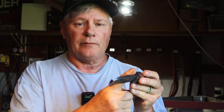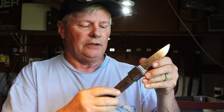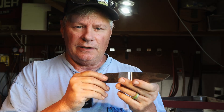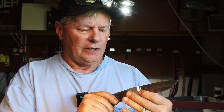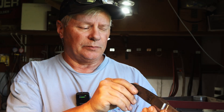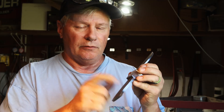You can do this with a grinder, but it is very tough. You can also come in here and bevel the back sides - you just have to match it with your handles or scallop. I'm also correcting the little offset I had in the spine as I go. I've got a reference mark so I can see it and make sure it's all good. It looks pretty good right now. All I'm going to do is keep cleaning this up to 600 grit and then move on to the next step.